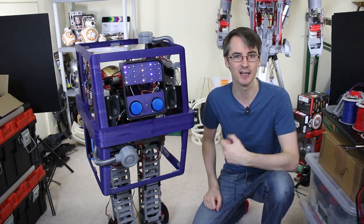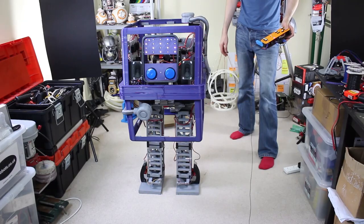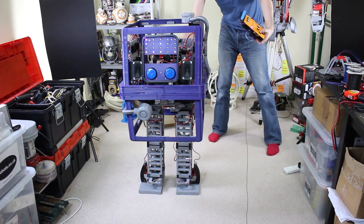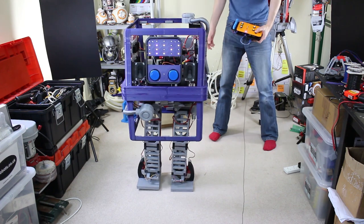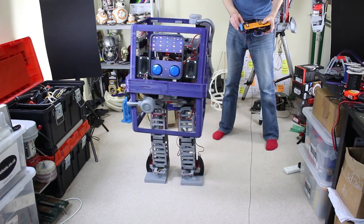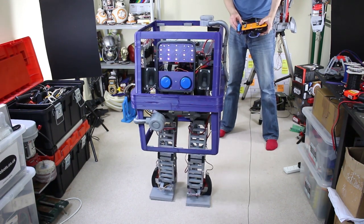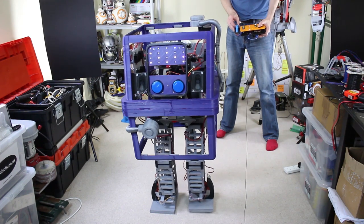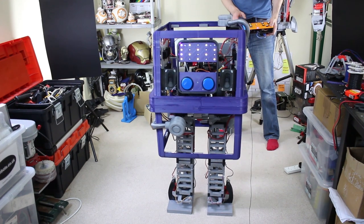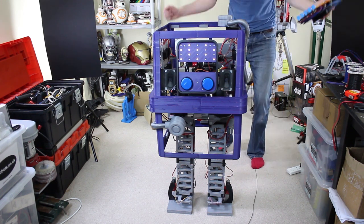For this build we're just going to have to increase the timers a little bit now that it's heavier so that it moves slower. After quite a bit of tinkering I've just tuned up those timers and it's mostly okay again. I've also widened the rest position of the legs slightly so they're a bit wider, which seems to have helped. It seems to walk consistently on the spot without getting stuck on one side or the other.